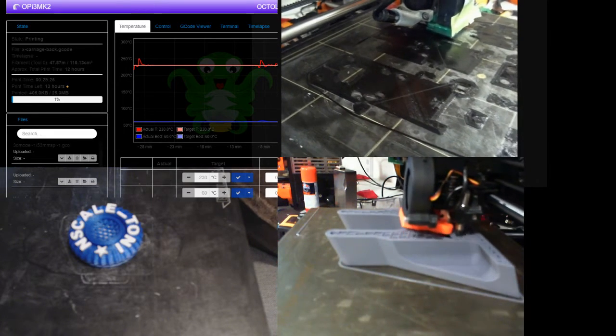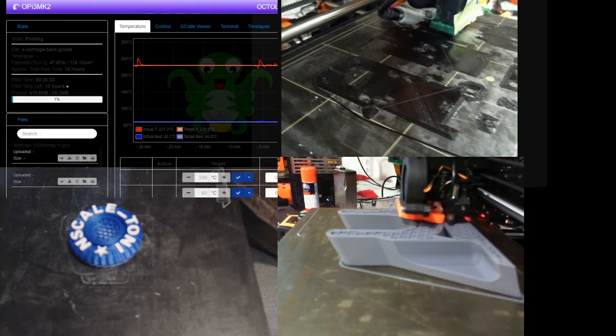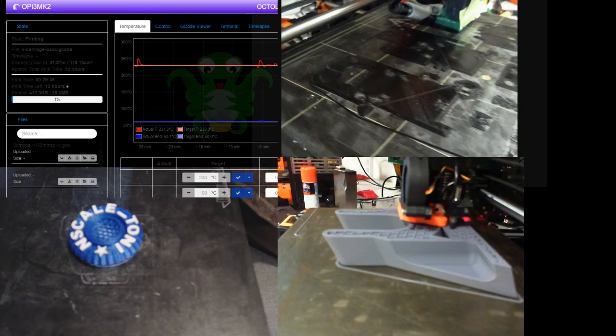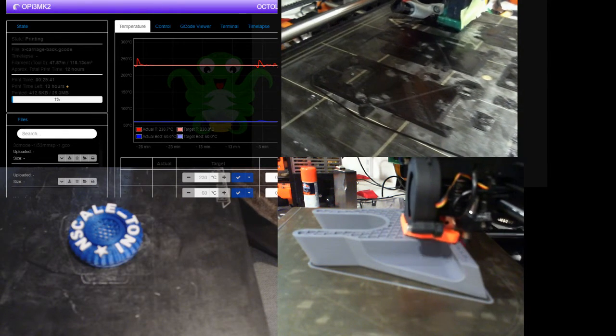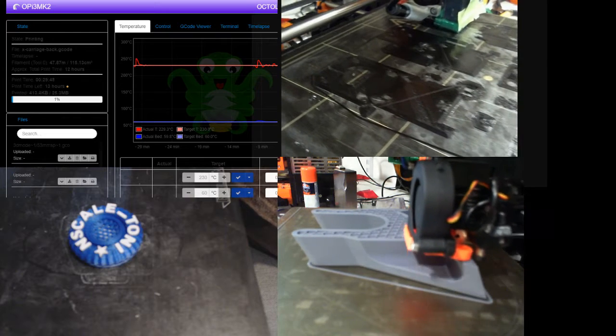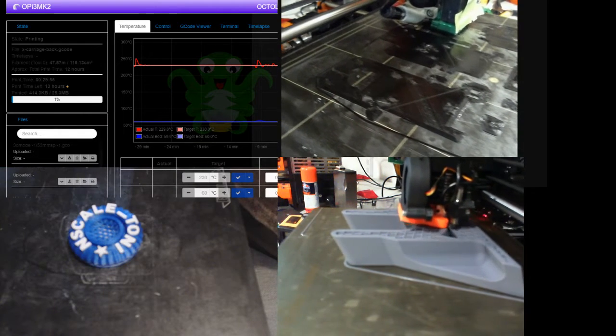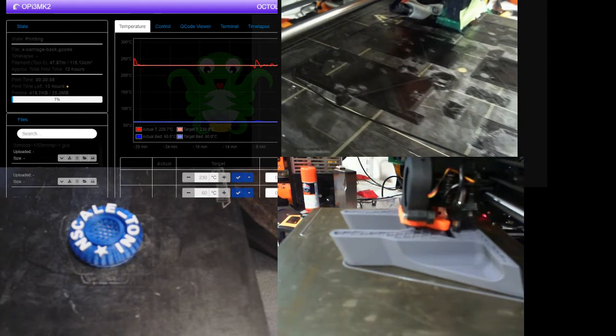Because what I'm finding is that if you get filaments from different manufacturers, each one has a slightly different viscosity as it's melted in there, and that Cyclops hot end seems to be very finicky on what it's going to let go through, because they don't want you to use more than 2 millimeters of retraction. Otherwise, you're pulling the hot blob too far up into the throat. I mean, they made those passages in there as tiny as they possibly could to try and eliminate most of these problems. So you didn't have a big pool of molten filament in there.